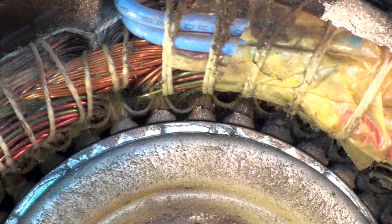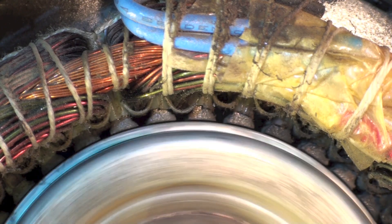The other way you can check these things — I'll have to find one with really bad bearings — is to wiggle that shaft and move it around. It shouldn't clunk. I've talked about this before but I'm going to get more specific on it. So if the bushings do wear out, usually that rotor will drag on the stator, and that pretty much finishes the bearings and likewise the motor.